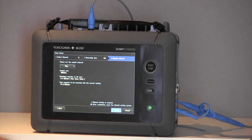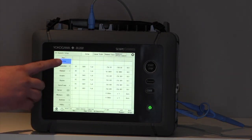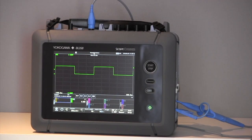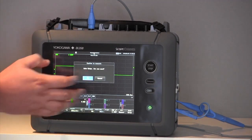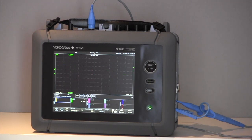When I go to Finish, it takes me onto the Recorder Mode. If I want to go back onto Scope Mode, I can navigate back to the menu and then go onto Scope Mode. Scope Mode allows me to do what is commonly found on oscilloscopes, which is do an Auto Setup. Auto Setup detects the channels that are active and turns off the channels that are not active.